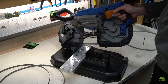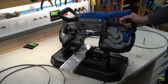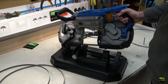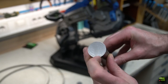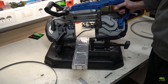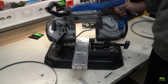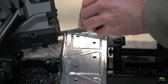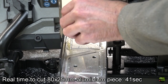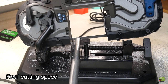First I put on the 10 to 14 TPI saw blade and tried to cut aluminium. It cut much smoother and faster, but if I pushed too hard the saw teeth still clogged a bit, which made the saw vibrate. Then I made some cuts on steel with the same blade — it cut faster and still made a nice cut. Then I put on the 6 to 10 TPI blade and tried cutting aluminium. It was very fast, but that blade also made the saw vibrate. However, there were no clogs between the teeth, so I figured out that the saw was grabbing too much material at once. Instead of pushing the saw down, I just needed to let the saw cut with its own weight, or even lift it up slightly while cutting. But when I added a bit of alcohol, the magic happened — it cuts super fast and the cutting surface is more than good enough for me. Smaller pieces also cut nicely without cooling, and that 6 to 10 TPI blade had no problem cutting metal or brass either.